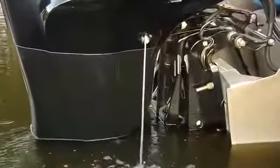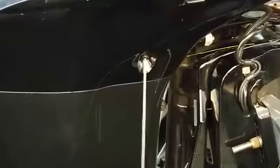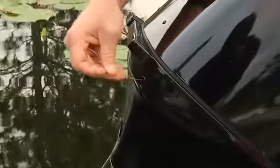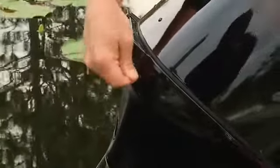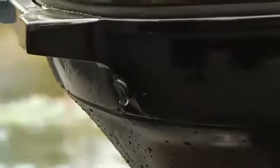Check to be sure you have water pressure for the engine cooling. On outboards, there should be a visual indicator in the form of a stream of water coming out of the back of the engine. If there's no stream, first check to see if the hole is clogged — a paper clip or small wire is a good tool for clearing a blockage. If there is no indication of water pressure after about a minute, or pressure is low, you may have a problem with your cooling system.